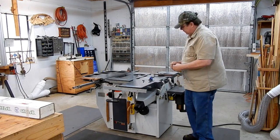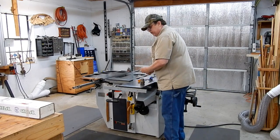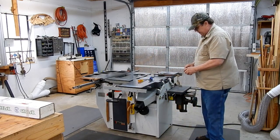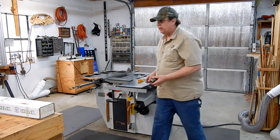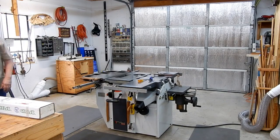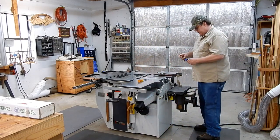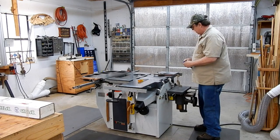The downside to getting the shaper head is that you've got to do this twice, because Laguna has essentially about eight different cutter heads they've used over the years. So you've got to take this thing apart and see which one you have, and order the according head. This one ended up needing an NLX head, and it took about three months to get because it's not one they actually keep in stock.